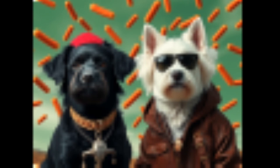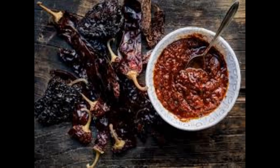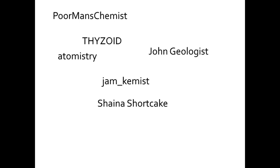Okay, I apologize. The primary objective of the reaction being discussed is to dissolve the copper ingot into solution with vinegar and copper sulfate. Each time the level of acid reduces, the goal is to top it up with fresh vinegar. The sodium hypochlorite was intended as an agent to speed up the reaction, as the last thing in conducting this experiment is to cause explosions or harm. Please read: the end aim of this experiment is metal recovery out of metal waste, so warnings of explosive reactions and danger are helpful, but that's not what we are seeking, intending, nor utilizing for any energy source apart from the molecular changes involved in metal dissolution and precipitation. Any gases produced are considered waste. Products to be safely vented.